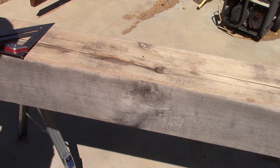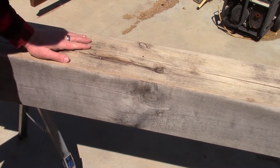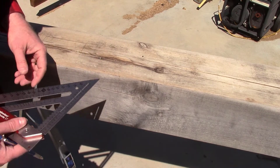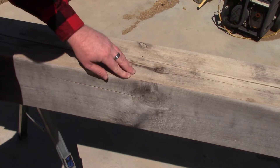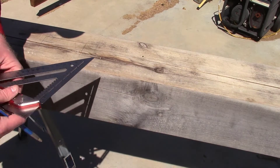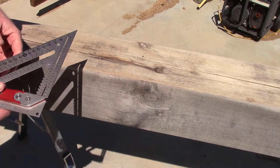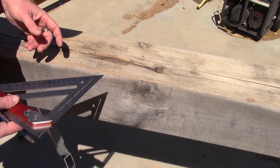So what does that mean? If I'm looking at this beam — in this case this is my post — I want to go through and make a mortise in it. First thing I do is I plane it, get a nice smooth edge that's straight that I can use as a reference for my marking tools. My wife got me a Woodpecker's carpenter square for Christmas last year, so I'm using it, but any kind of carpenter square or straight edge will work.